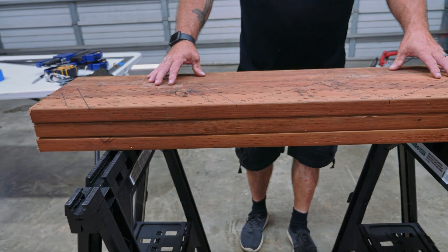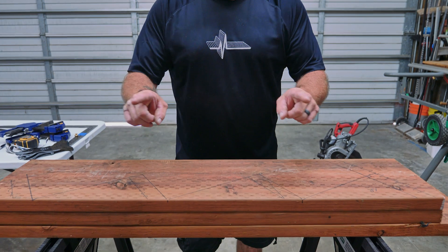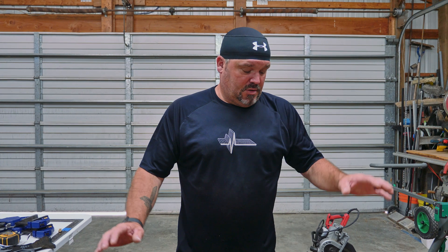This is for entertainment purposes only — hope you enjoy it. So now what I've done: I had one long 12-foot piece of 2x12, did my layout, cut it up, and now we have three pieces. When you're laying out stairs, if there's a bow in the board, you always want to make sure that bow is pointing up. That's pretty basic information, but sometimes people forget. Always bow your material up so that when you're coming down your stairs you don't already have a negative on top of another negative.